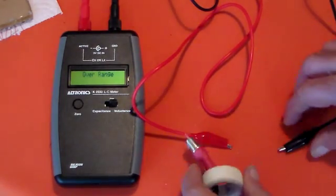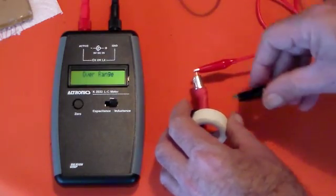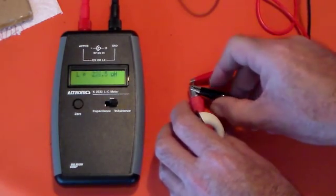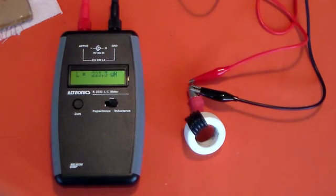And back to the peculiar one, the very high inductance one. Come on, you did it before. Just get on there. There's a slight variation there with the leads. We're not interested in laboratory conditions to the microhenry, but there we go, 223.1 microhenries. So that's 222.8 something before. So it's a slight bit of stray inductance around it. Oh, there you go. It's settled back to 222.9 microhenries.